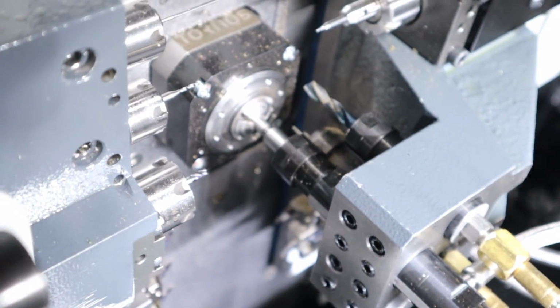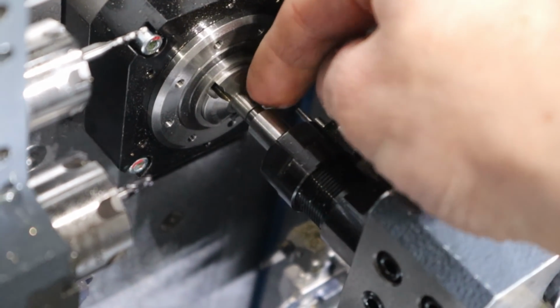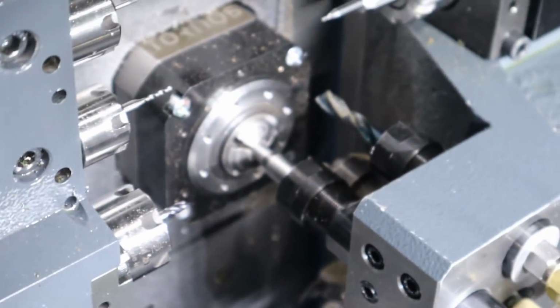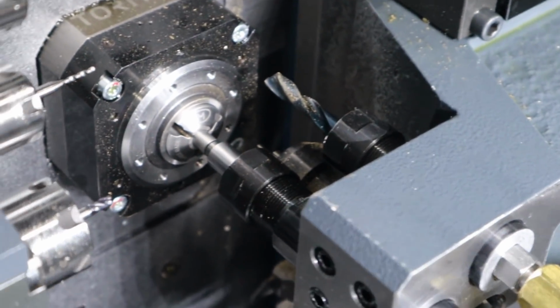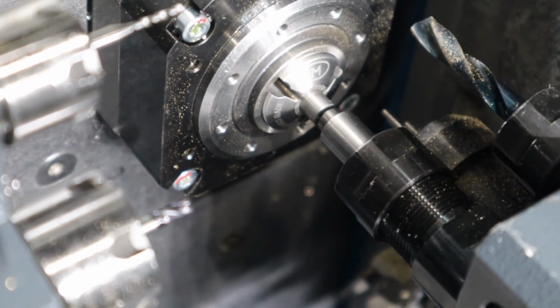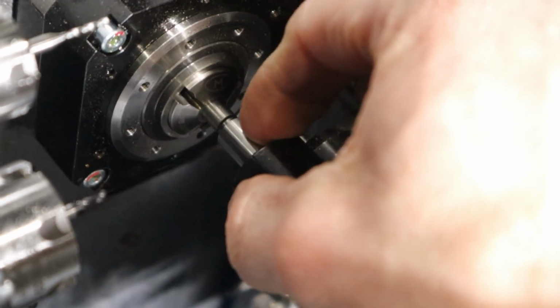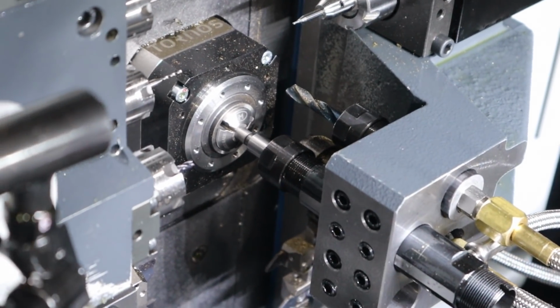So you see the gap right there? That little space right there. Here, let me move the Z out. So notice how the bar is getting right up close to the material, to the tool. My drill bushing now slides perfectly between the two, which means they are exactly lined up. And I'm able to feel this within tenths. I can feel in X and in Y if that feels good or not. And it works good. Works really good.